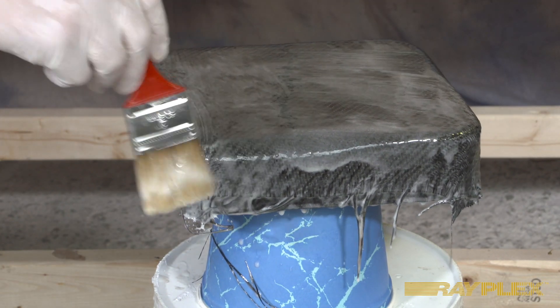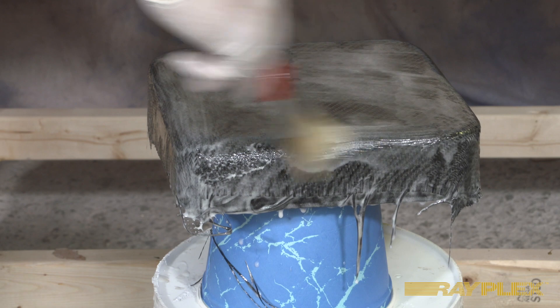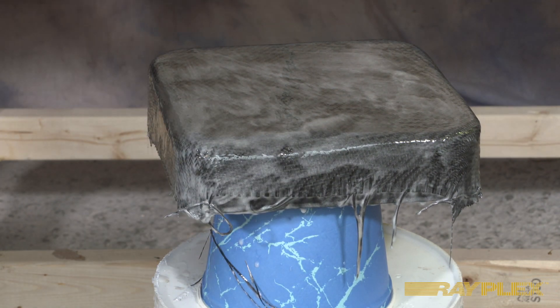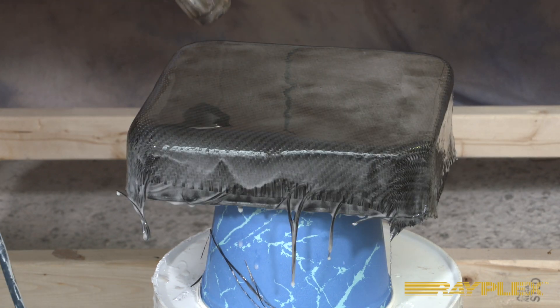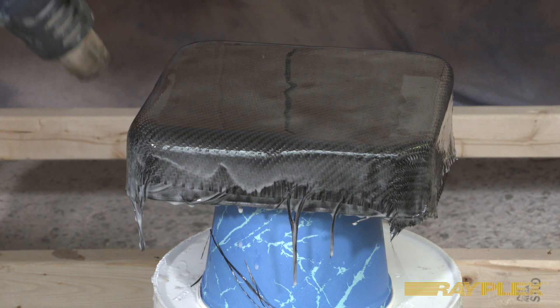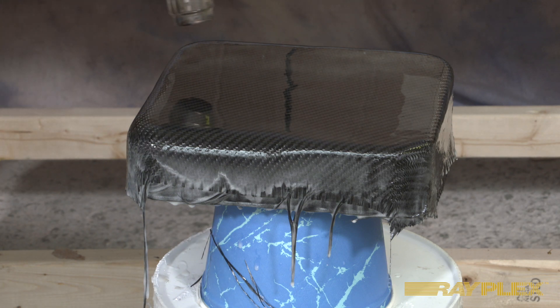I should mention there are different types of carbon fiber. This is a twill, and it's usually one of the easiest to get the air out and to move around. Let's run the heat gun over this. I prefer to use heat guns versus torches just because of the safety — a live flame with chemicals could develop into a disaster in very short order. Once epoxy gets warm, it tends to release the air.